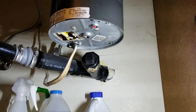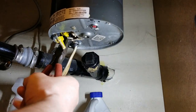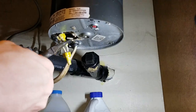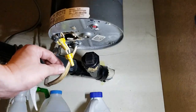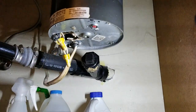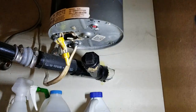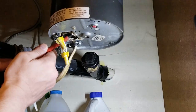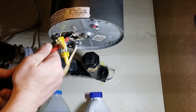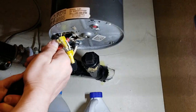You may have to get a cord retainer because it doesn't come with the disposal. We're also going to need a little 3/8 ratchet on top of the other tools. Now let's remove these wire nuts — it's much easier with some needle-nose pliers. There isn't a separate ground wire; the ground wire that comes in through here is actually screwed in with a little cross screw. That screw's a little corroded, but sometimes Phillips really aren't very good in these situations. That's why these screws have both slot head and Phillips — slot head really just has a lot more grab with a flat blade in the slot.